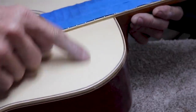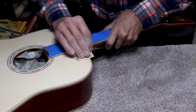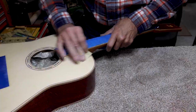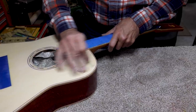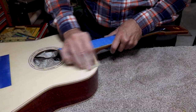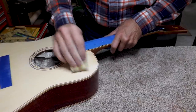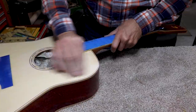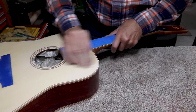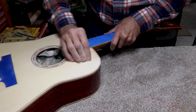They're right in here — you can see those marks. Once you get runs, it's very difficult to ever get rid of the look of that. You can do it, but it's not a real simple thing. So you try really hard not to get any runs. It would be far better if there were no runs on the front, but you just have to sand until they disappear, and oftentimes that's a lot more sanding than you would think you'd have to do.